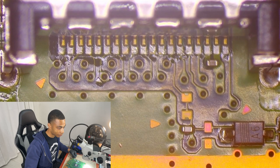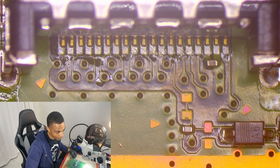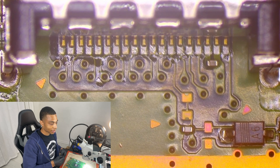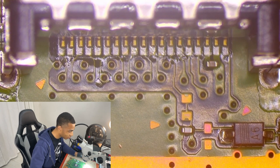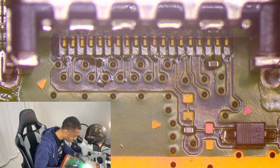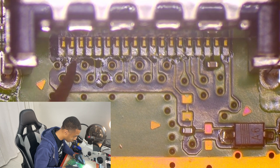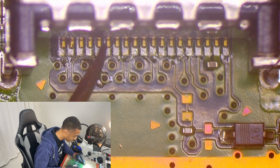Here's the PS5 HDMI port — the new port under a microscope. I mentioned gold pins earlier; as you can see, we still have those gold pins. I did put flux on the port, but the solder didn't get a chance to transfer over. Now this is the important part: you want to make sure that the pins from the HDMI port are making a secure connection with the traces or pads from the PS5 motherboard. We take our tweezers with the pointy tip and push against the pins on the HDMI port to make sure they're soldered on.